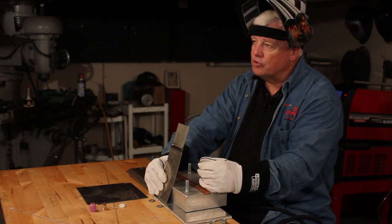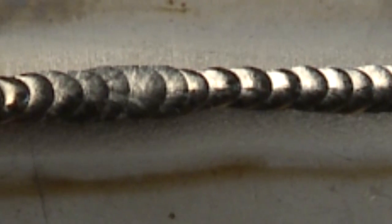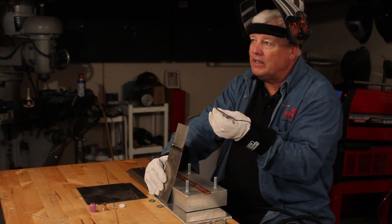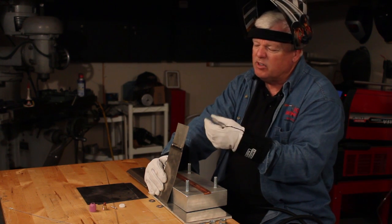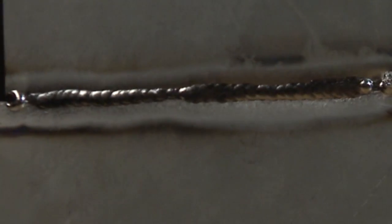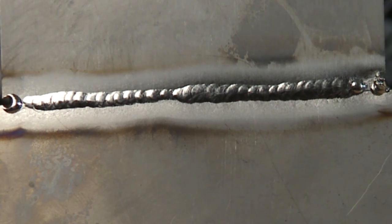I've taken the plates out of the fixture, and you can see the color. What's really critical is the weld itself — the area that got liquid and re-solidified has an ideal color of silver, and you can see that this is pretty much there. You'll notice some other hazy colors away from the weld, but those are actually far beyond the heat-affected zone, so they're really having no impact on the overall strength of the material. There's no intergranular attack or anything to be concerned with. Let's take a look at the backside — remember, we had argon flooding from the backside as well. Turning the part over, we have 100% penetration, the backside of the weld is silver, and you'll see a little haze away from the heat-affected zone in a non-critical zone. This is a pretty successful weld.